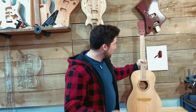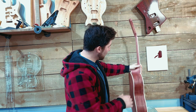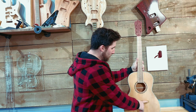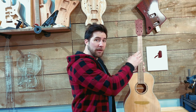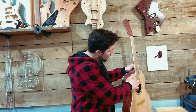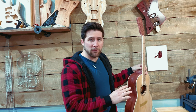What's up guys? Welcome back. Today we are working on this acoustic guitar kit again. We haven't glued the neck in yet — I've just got it kind of set in there. So in today's video, we're going to check and make sure the tape's in the right place, get the scale length all sorted out, and basically just make sure that the neck is properly positioned — that includes how far away it is and the angle. We're going to get the pocket cleaned up a little bit because this doesn't press quite all the way down right now, get this thing ready to glue up. That's today's video. Let's get after it.